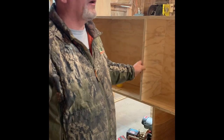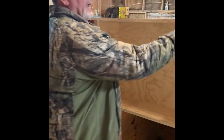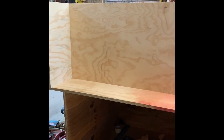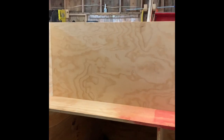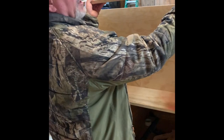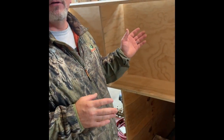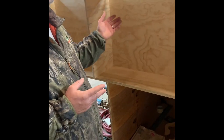We've got the pieces in — done off camera. Now I'm going to put the side on. I ain't got it nailed yet, so I'm going to take it down and show you what to do. You take your glue and go all the way around your edges, all the way down, then you just nail it on with the nail gun — inch and a quarter brad nails. Set it back up there, level it out, and nail it on at the edges. I'm going to do it off camera because it takes a while — I just wanted to explain what to do.